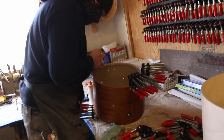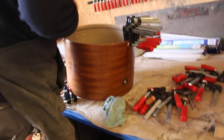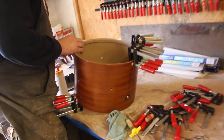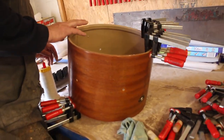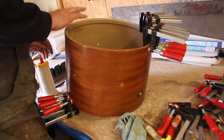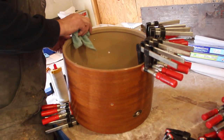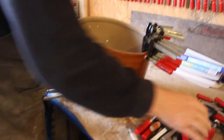I'm seeing some cracks so he probably isn't happy about that. First order of the day - Bill found a couple more separations on this older rod tension drum, so he's syringing some glue in and clamping it. This is actually a mid-century Slingerland marching snare. Over the years I've worked on a lot of these, and whoever made this particular shell was having a bad day - it might have been his last day at the Slingerland factory.